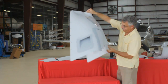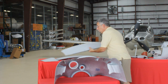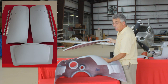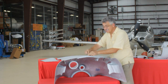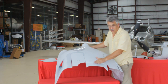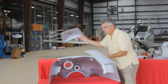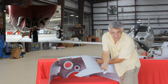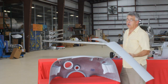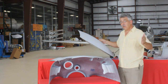Something really cool: you'll notice the trailing edge of this cowling is curved — that's for a purpose. We have new nose gear doors that are also part of the kit. They overlap and close like that and land on this bump. This blend goes way up here back into the cowling — this is the normal shape and then we start bumping up onto the nose gear door shape. Aerodynamically, these doors are much longer than the stock doors — overlapping, smooth, no lumps and bumps — and longer length means a smoother transition.